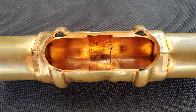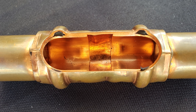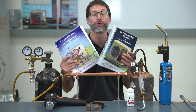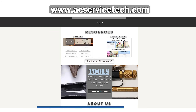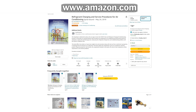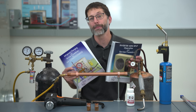While flowing nitrogen through the system - and instead of brazing, you could use press fittings. Here you can see a cut-open press fitting where the O-rings and the copper are all squished in place. I also recommend pulling a deep vacuum below the 500 micron minimum - I typically target about 200 microns - to remove any water vapor from the system in order to protect that POE oil and therefore protect the system. I hope this video has helped, and if you want to learn more about HVAC, make sure to check out both of our books available at ACServiceTech.com. We also have free articles, quizzes, and calculators there. Make sure to check out the Inverter Mini-Split Operation and Service Procedures book and the Refrigerant Charging and Service Procedures for Air Conditioning book, both available at ACServiceTech.com and also on Amazon. Hope you enjoyed yourself - we'll see you next time at AC Service Tech channel.